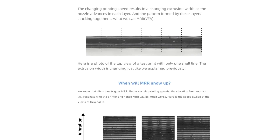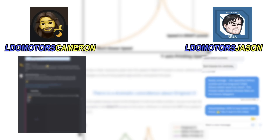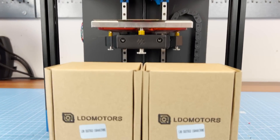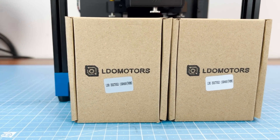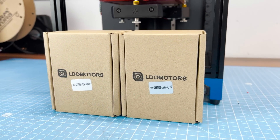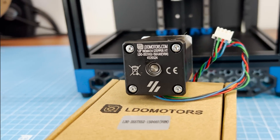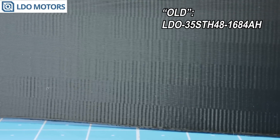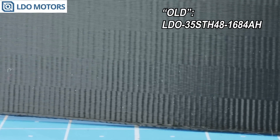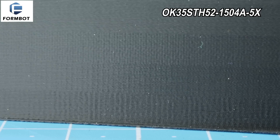So I wanted to find quick and easy solutions for my viewers. In parallel, I talked to Jason and Cameron from LDO who are aware of that issue. There is good news for future buyers of the LDO kit: actual kits are shipped with new motors — the 35SDH52. Jason was kind enough to quickly send me those in order to recheck the problem for this video. Changes in winding and improved accuracy of the construction decisively reduce the VFA problem to around the same quality level as the Oukeda motors of the FormBot kit.